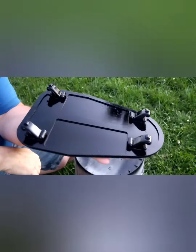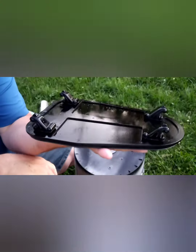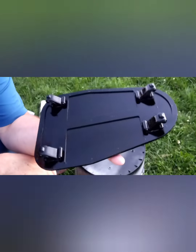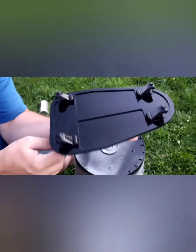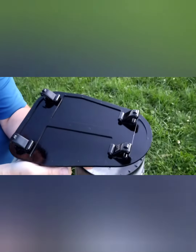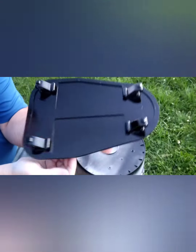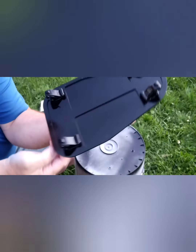Okay, I shot the black lacquer on there, and I did shoot a little polyurethane just on one little spot. I wanted to see if it would lift, and it didn't. I should have washed it a little bit more right through here. On the bottom side, I did get a little fish eyes right here where I didn't wash it. I should have probably Dawn dish soaped that a little bit better. But it'll be all right because I'm not done with it anyway, so I just wanted to test it out.